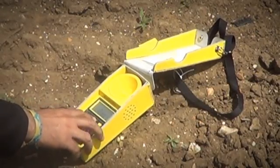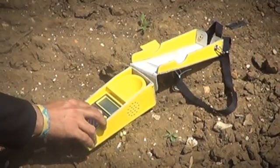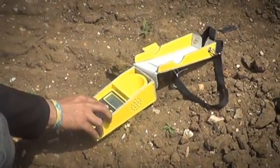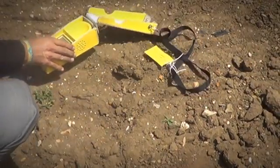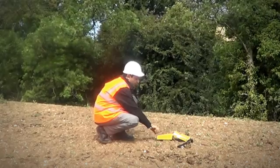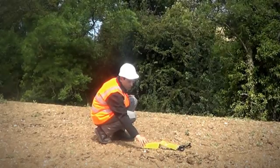Once on the ground, clear away any overhanging vegetation and press the measure button three times, ensuring your head does not get in the way and that these figures agree. Then place the instrument 30 centimetres to the left and take three readings. Repeat this process again 30 centimetres to the right. This ensures that you are picking up the correct cable.